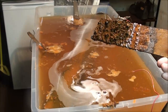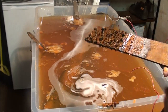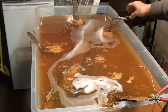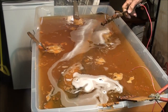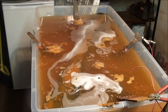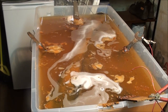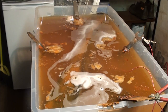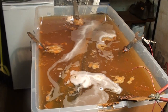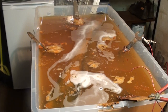This much material has been deposited on the anodes since yesterday. I'm going to turn the thing off and clean the anodes off. The water is pretty funky looking now, and I'm going to flip the work over — the hollow mandrel — rotating it 180 degrees.